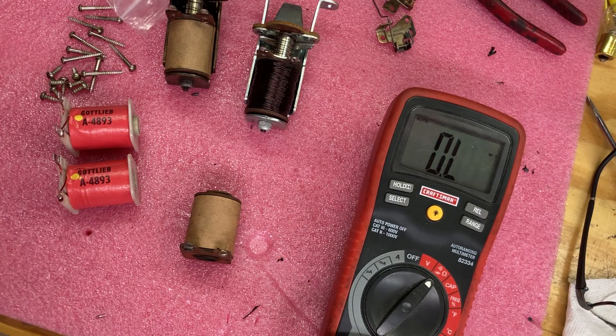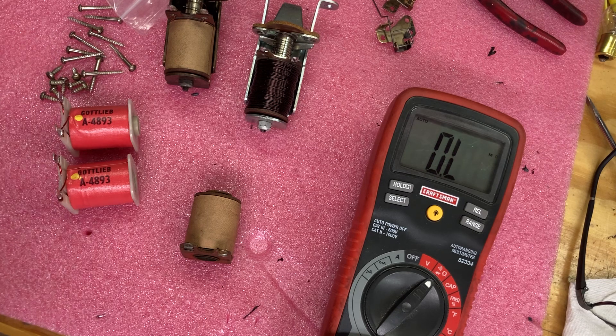Hey, it's Lebo with Lebo's Pinball. I was having a conversation through some YouTube comments that I thought was kind of interesting — they were comparing yellow dot coils to standard coils, more specifically the flipper coils: the 51-41 standard ones versus the 51-41 yellow dots. Really, what's the difference? I've kind of heard it's about a 10-15 percent extra harder hit or a little more force, but nothing that's an actual real quantified measurement.